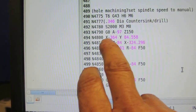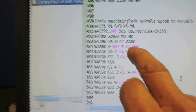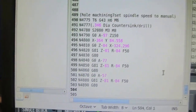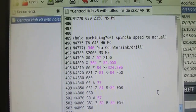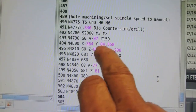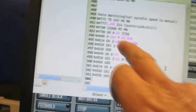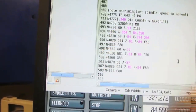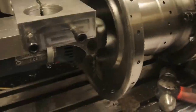Then we've got a line of code: X minus 364, Y 84.558. The Y puts the center of the hole right under the drill bit. It's offset from the main spindle, that's why I can't use a zero reading there. Zero is still valid for this job if you like, but I've put that offset in, so it becomes Y84.558. You can see it's actually still on that. So that's my Y-axis. X minus 364 — at the moment it's at 327, and you can see it's fairly close to the bottom.